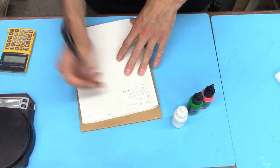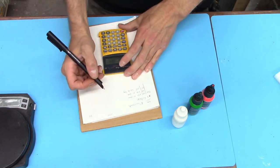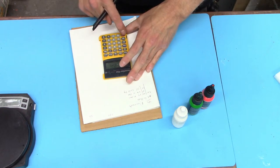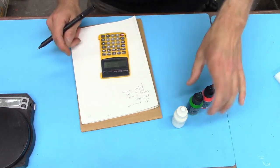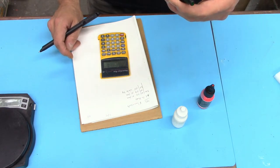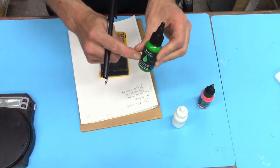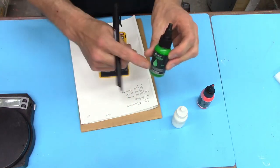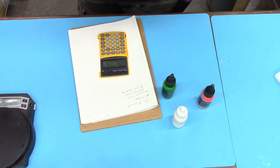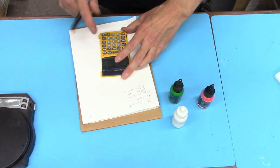Technically, 5% of 216. That's a lot. We're going to go a little bit less than that. I don't think that's right. I think they kind of messed up. I think they're really talking 2.5% if you factor it against the total amount of resin. I would recommend going maximum 2.5% on this. Typically the way Alumilite does it with their dyes, they're talking about 5% factored against half of the resin. So I'm going to stick with that. That'll be about 5 grams basically.